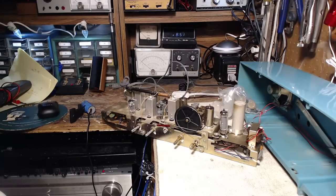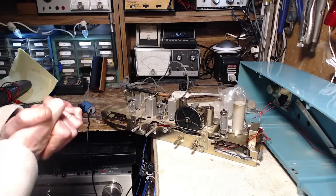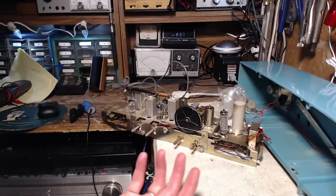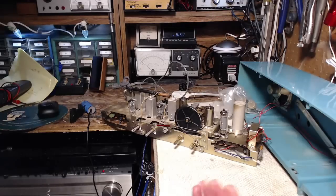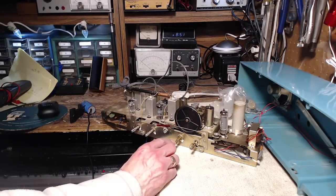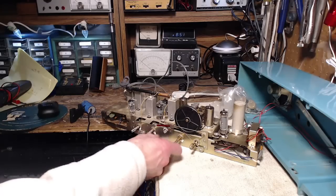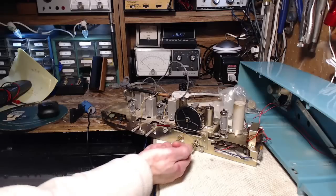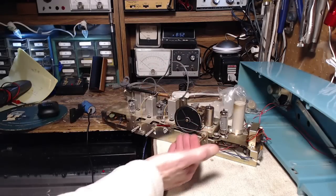That's kind of interesting. A lot of these AM/FM radios, when you switch bands, you actually energize the FM circuits — maybe the AM circuits remain energized — meaning the B+ high voltage is applied to them. So it would make sense if you wanted to indicate FM to hook up the FM indicator light to the B+ that comes on when you switch to FM. What better light to use than one that draws almost no current — a neon light? That makes a lot of sense, except the band selector switch has a little red dot on it, so it's easy to see which band you've switched to just by looking at the switch.